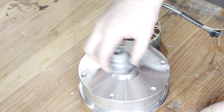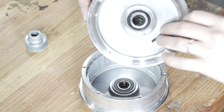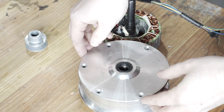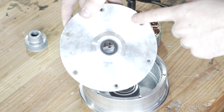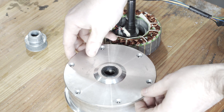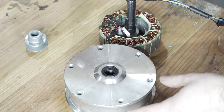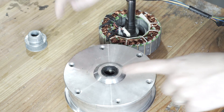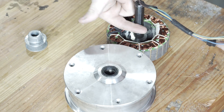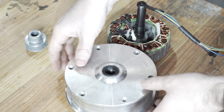So we need somehow to get a pulley of some sort, either machined or something like this, onto this case somehow. A few ideas: there's this faceplate, which comes off — it's aluminum, it's got a bearing on the inside, and it basically just protects everything, keeps it covered. There are a variety of drilled holes already, so what I could do is fabricate a new plate and have that plate include a pulley. I could fabricate a pulley on top of this, the only thing is it'll be contending for space against where this bolts onto some support.